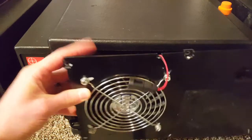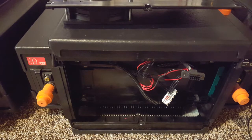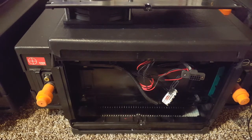For right now I just wanted to talk about these modules and how I plan on using them. They're basically going to be backup power for my sump pump and things like that if the power goes out. I have two and a half kilowatts of solar panels in the back, and I'm wiring those in with a Morningstar TriStar MPPT charge controller. All of that's going to get wired together on a single rack — these modules will go in the bottom, wired in parallel and then in series, and that'll be what I use for backup power.